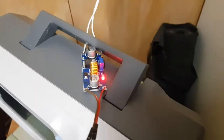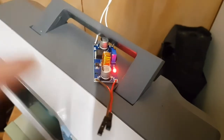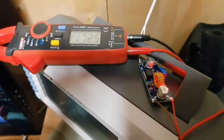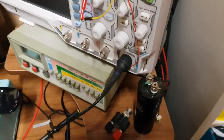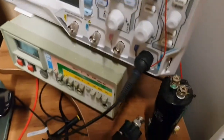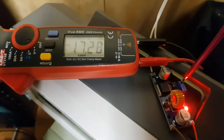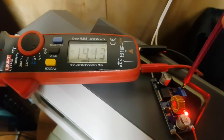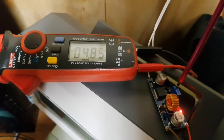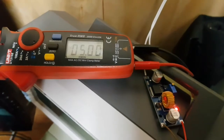All we've got to do is put a DVM on the output here and we can set the voltage. We're going to set it to 5 volts, and we do that by twiddling the pot. I've got the DVM voltmeter plugged in measuring the output. Here's a tip: if you use two different sized wires when you hang leads like this, the two ends can't short — if they're both the same height they could touch each other, but different sizes prevents that. I'm just going to adjust it down until it reads 5 volts, then nudge it up just a tad — bang on.